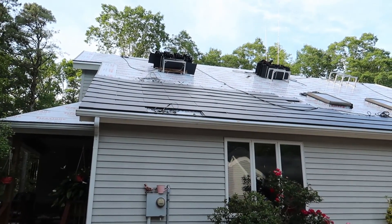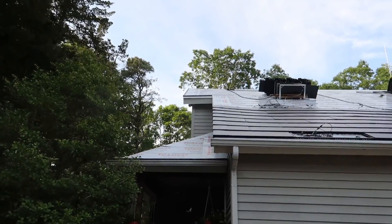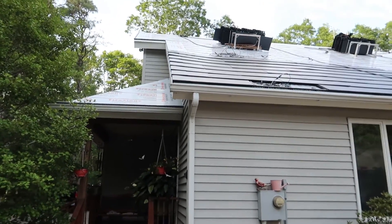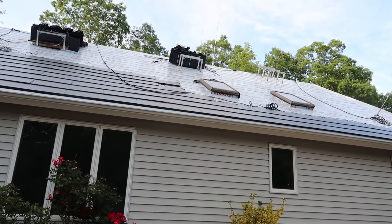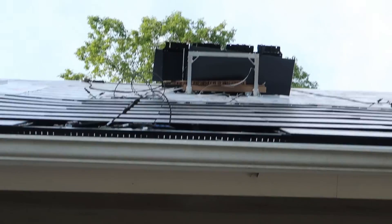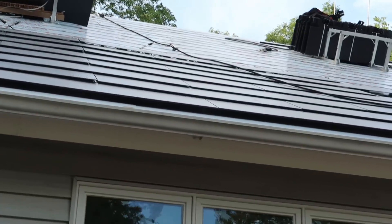You're probably wondering what actually happened on this first day. We see some panels here — this is a mix of glass and solar panels. First, they start by outlining the entire roof with what I believe they call a C-bracket. It helps them line up the whole roof and runs top to bottom. It does not go across the top — there'll be a ridge vent up there for that. You can see little cutouts in it so rain that gets under there will just run out the bottom.